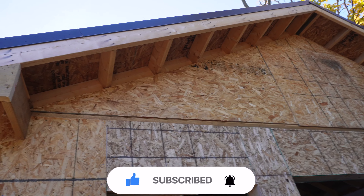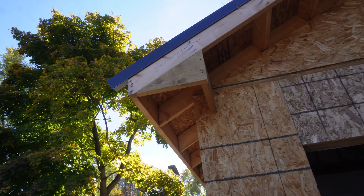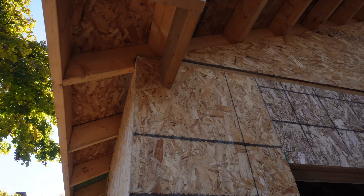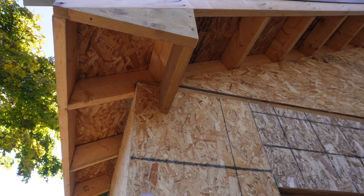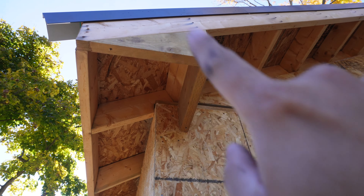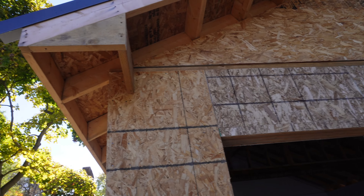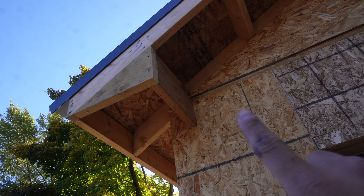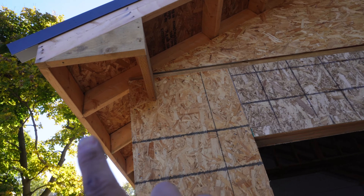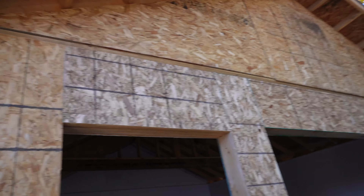After the sheeting was completed I finished off these — I don't know what you call them — like a bird's mouth return. I always find it way easier to put the sheeting on first and then build these after. I would maybe suggest putting the house wrap on first and then building these after, so the house wrap would just end up behind that piece. It's easy to wrap the house wrap around the corner without those in the way, but no big deal.